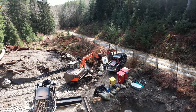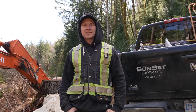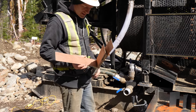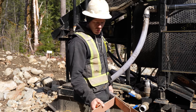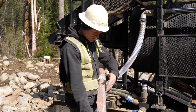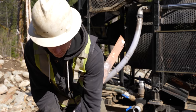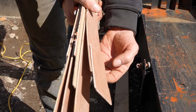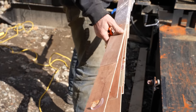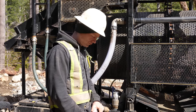We're getting the template made for the metal sheet to reline the hopper. What I've got here is really thin strips — it's door skin, a really thin particle board cut in strips with perfectly straight edges on a table saw. You glue these together with a hot glue gun, and it lets you trace an exact template so we can custom cut a piece of metal to line the bottom of this hopper.